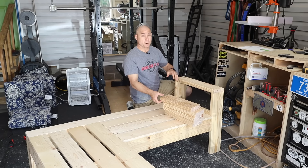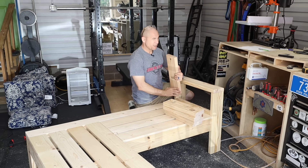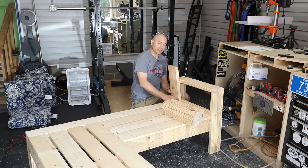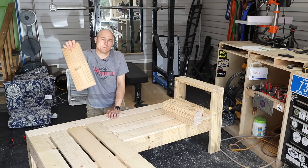Now it's time to start putting the backs on. We've got the 10 degree angle on the top and the bottom, and then we're going to put a top piece around the top to protect that end grain — it'll help it last longer and it'll look better. We're going to set these on there on the pieces where the armrests are, just screwing into the armrest from the side, and that'll secure it there. No need to secure it anywhere else — one here, one on the corner, one in the middle, one on the end.